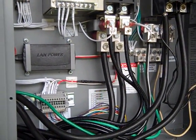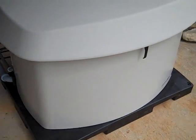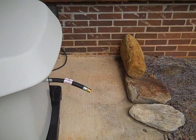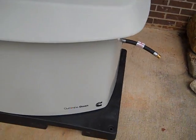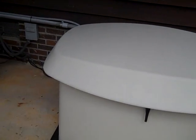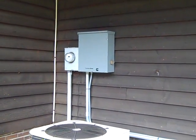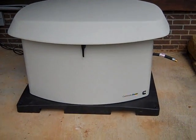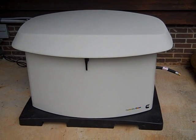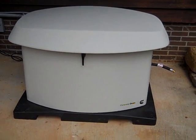I'm going to let Scott tell you a little bit more about it. We have everything buttoned up — the transfer switch in place and the Cummins Onan generator ready to go. Battery is in it, and we're just waiting on the propane company to come hook us up, then we'll be ready to do some testing. If you need any help specking out a Cummins Onan generator, be glad to help you. This is about as good as you can get in terms of a propane gas generator on the market. They sell diesels too, but diesels only start at 20kW and up for Cummins Onan right now. I'm still looking for a smaller generator option for preppers in that 7 to 15kW range. But for now, this is going to work out great and will pull everything that this house needs to run.